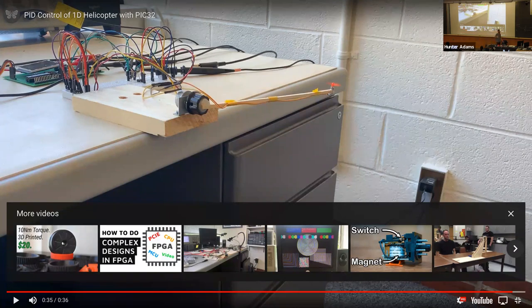You're going to be building quite a bit of external circuitry to drive this whole thing. Associated with the motor is a motor control circuit, and there's also a circuit to isolate the motor from the PIC32 and other elements, because these motors kick up unbelievable amounts of noise. If you allow the DC motor to share power and ground with your microcontroller with no filtering, it's enough noise to reset your CPU a thousand times a second. There's also external circuitry associated with the potentiometer to low-pass the input going into the ADC and set up an op-amp buffer for that ADC input.